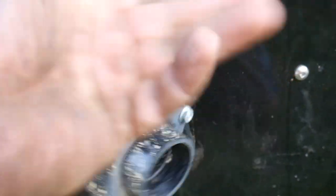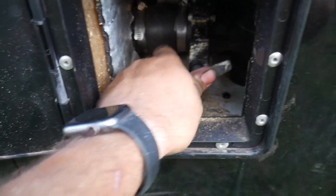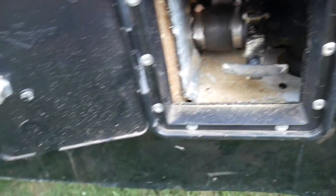This little hose adapter is the piece you attach the sewer hose to — it's glued on here and will snake into position through the hole, coming out below. A little rubber adapter connects the two pieces, and then there'll be a piece of three-inch pipe going up to the 90 on the septic tank. The valve hangs down so you reach your hand right up and grab it. There's a little flexible hose in there in case the tank moves — it's not ultra tight, might shift about a half inch, but that'll keep it from breaking anything.